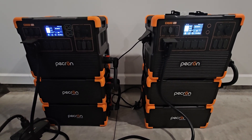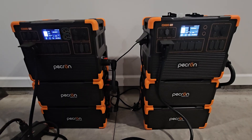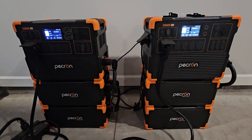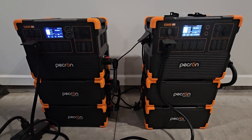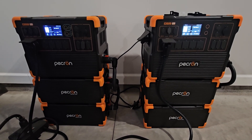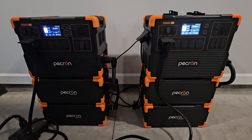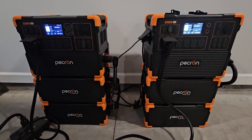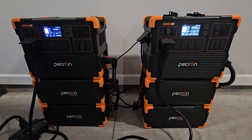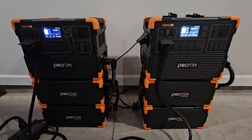I just wanted to post a quick update showing both of these units working and running 240 volts. It'll run my water heater just fine, but it just does not have the power and capacity to start and run a three-and-a-half ton AC. Honestly, I knew it was right on the edge of being possible anyway. Just like in my RV, I couldn't run the air conditioner, water heater, and microwave at the same time — my RV is limited to 30 amps no matter what.